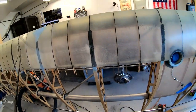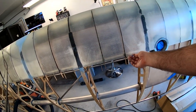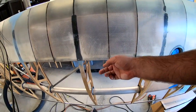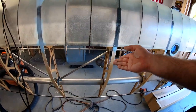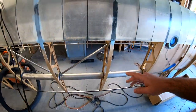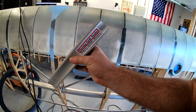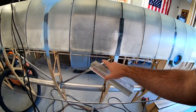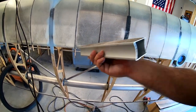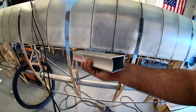One thing I didn't do, and I regret it, is sand the other side, because I cut it, and I was like, oh, this side will be fine. I didn't cut it. Well, somebody cut it. It was pretty rough. So I had to come back through after I had glued it on and sand these areas, and it's just not great. If you get one of these permagrit sanders that I mentioned before, sand the side too before you glue it on. It needs it. Just go all the way down a little bit, flip it over to the lighter grit side and go after it.